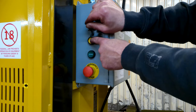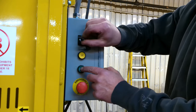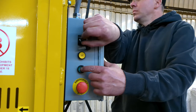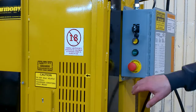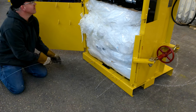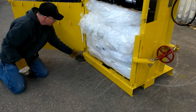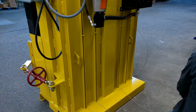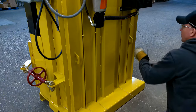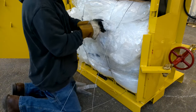Open the loading door and place a flat sheet of cardboard on top of the bale. To tie and eject the bale, insert the key into the keyed selector switch and turn it to the hand position. Press and hold the green down button. When the ram stops moving in the downward stroke, press the emergency stop button and turn the key switch to the off position. Use Harmony's clean-out rod to clear any debris from the lower floor channels and platen channels. With the upper and lower doors open, insert wire from the front of the baler through the channels in the bottom of the baler with the looped end in front. Pull the wire back through the upper channels of the platen toward the front of the baler. Insert the end of the wire through the looped end, pull tight, and twist until tied. Repeat the process for each tie slot.